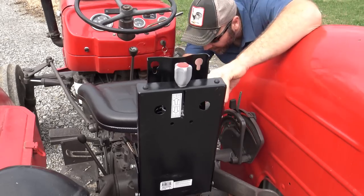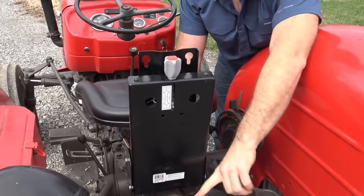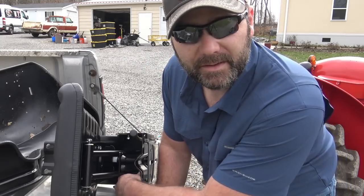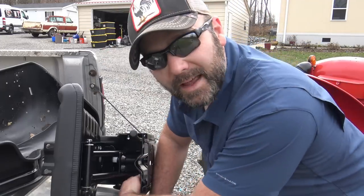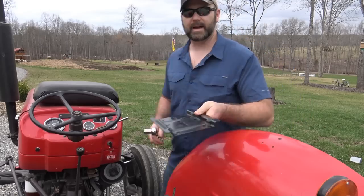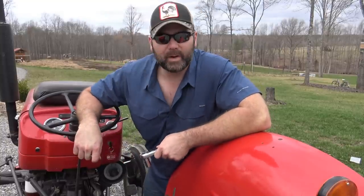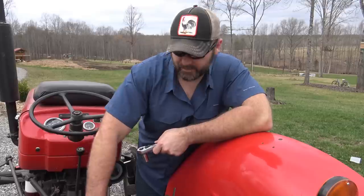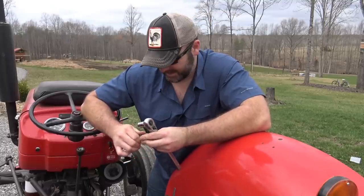Next step: set it in place where we want it mounted and account for clearance — are we going to bump against this part of the tractor? I'm having to eat a little crow — I didn't read the instructions. You need to take a bolt out underneath, just loosen it up, and the whole mounting plate slides right off. You squeeze the slider and the mounting plate comes off. The mounting plate sits right on here; it's a little different than the original design, and I'm questioning whether it's going to work properly. We'll see — let's go ahead and install it.